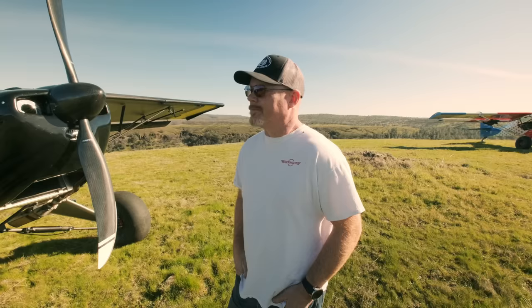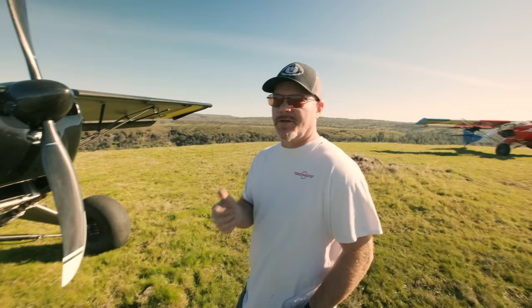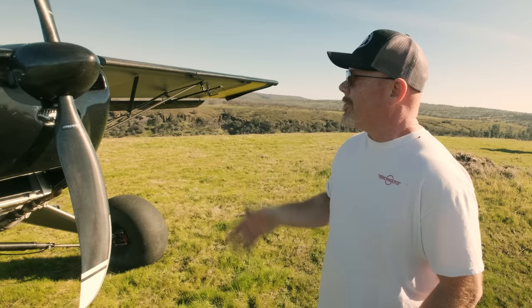Yeah. And really quick, going back to the engine. So it's a snowmobile engine, and what? It's an inline four-cylinder. Yeah, it's about a 1,000cc inline four-cylinder, four-stroke. You say snowmobile engine, everyone thinks you're putting a two-stroke in there. But it is a four-stroke, five valves, and it loves high RPM. So it runs a lot like a two-stroke. It's got a smoother power band, but the RPMs you run it at are very similar to running a two-stroke. And then the gearbox is what makes this possible, and that's from Teal Jenkins at Skytrax, who designed a gearbox specifically to mount up to this engine.